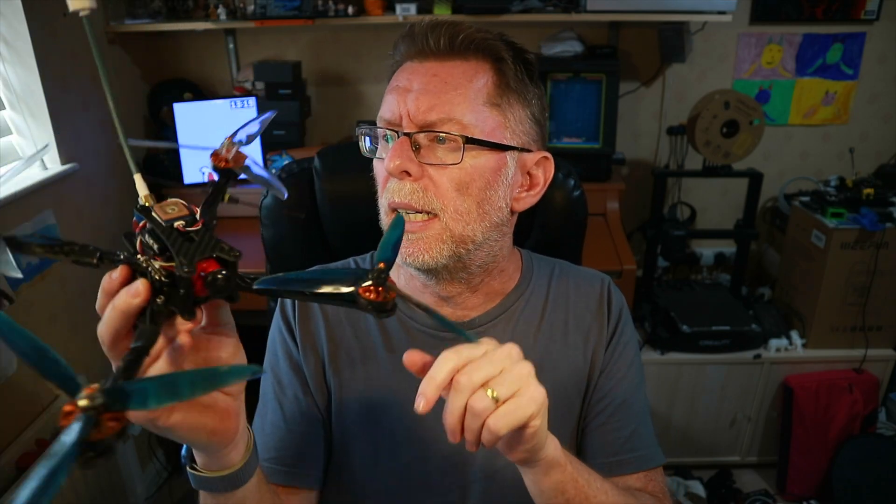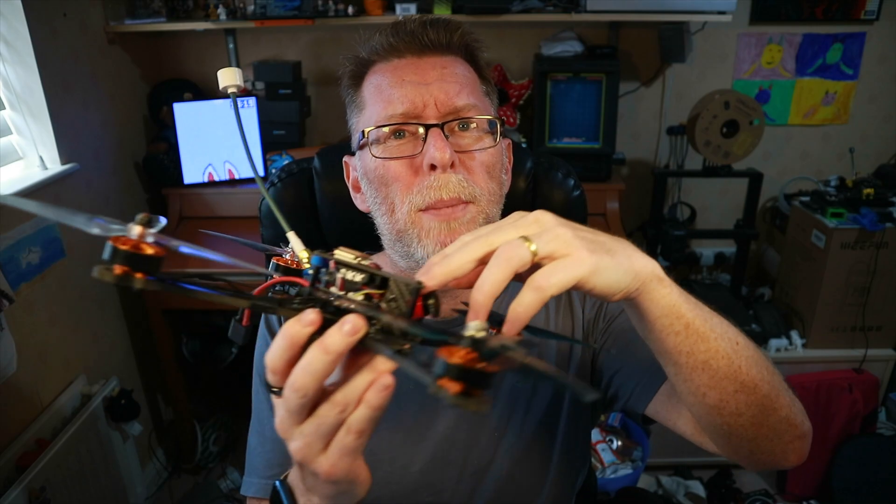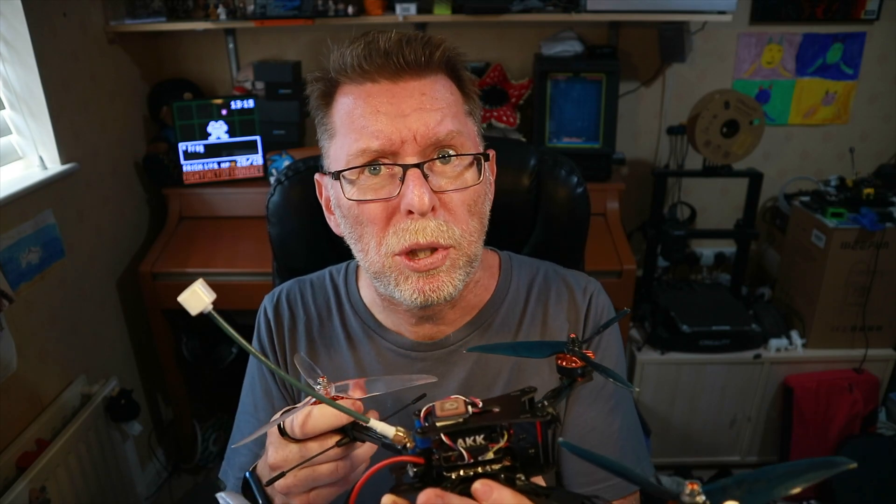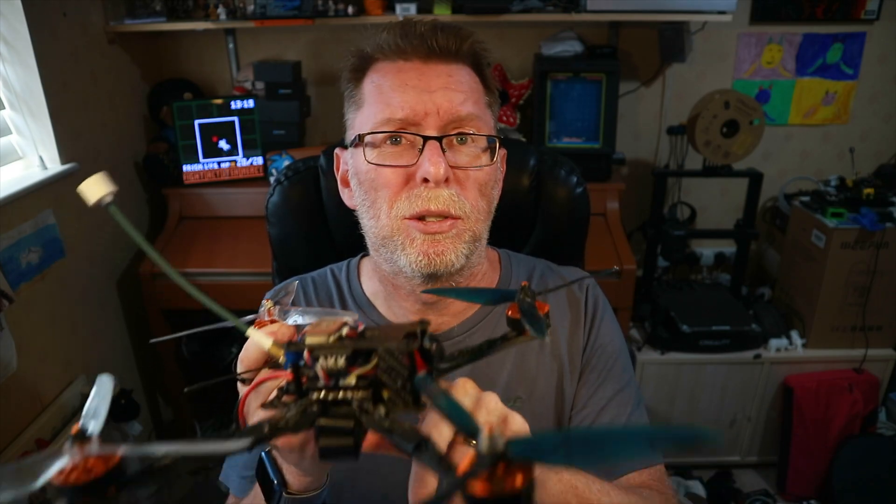They are going to go into this 7-inch quad because I've changed almost everything out on it already, so why not finish off. Perhaps the bit I'd like to change most is the motors — in another review I've got four Q2812 motors at 1115 kV, which I thought sounded a little low for a 7-inch on 6S, but they thought it was a good way of getting more endurance. So I'll put these in first, try flight, see how it feels, and then after that I'll come back in a separate video to see how those motors feel. Let's go first to close-up to see exactly what's in here.